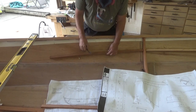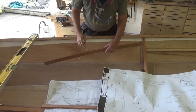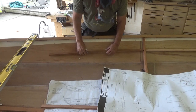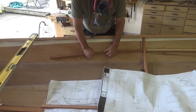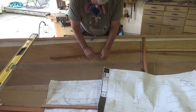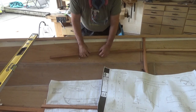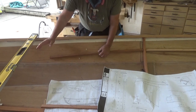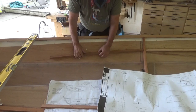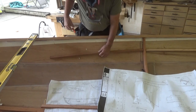Once the piece cooled off, I calculated the angle required to cut the back edge here, so the top edge would be level to the other side. I have my marks along here. When it springs into place, it doesn't exactly come up level to my lines, but I'm not too concerned about that, because there'll be a full-on bench seat here attaching to the bulkhead up front on the cleat. Therefore, ready to just clean this up.